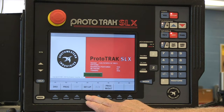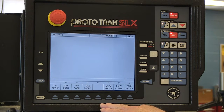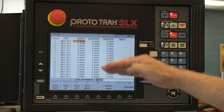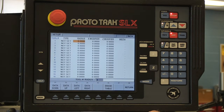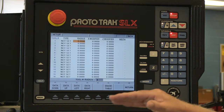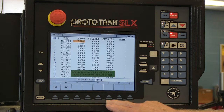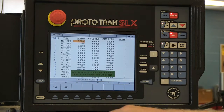If I select my setup, I'm going to do a couple of things first. I'm going to take a look at my tool table and see that the tool table is blank. That's a worthwhile step in starting this machine, because especially here at the college, perhaps somebody last night left some tools and information in here. If there's information left over from the previous user, it's going to make it difficult for you to set up your machine properly.